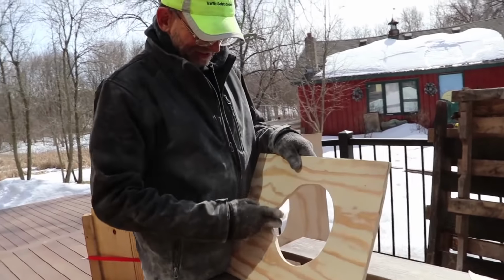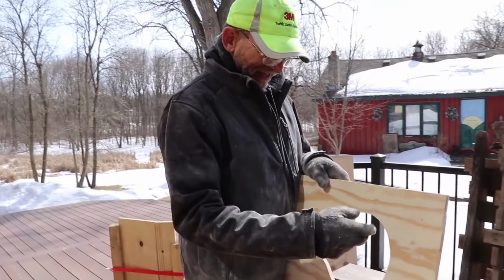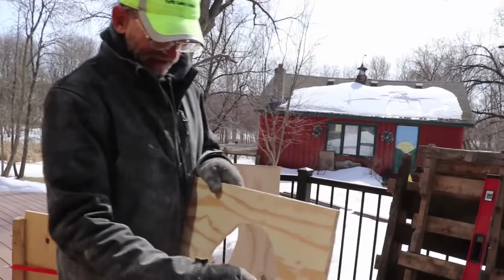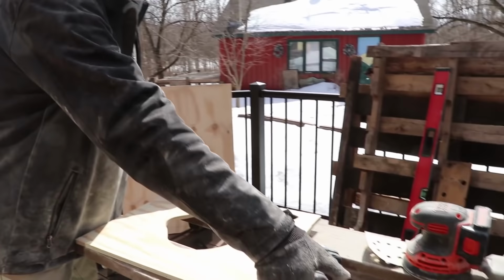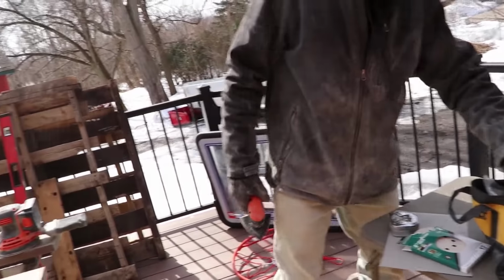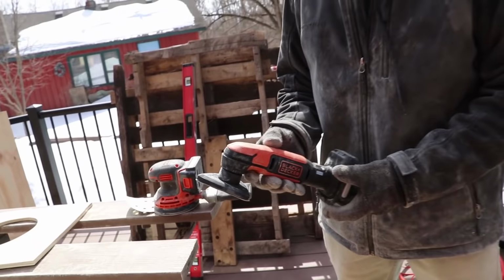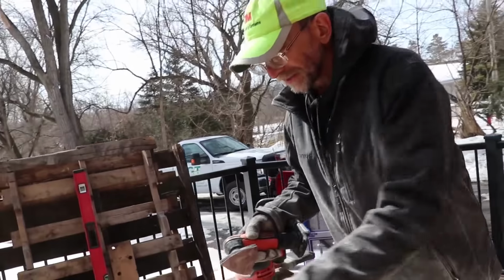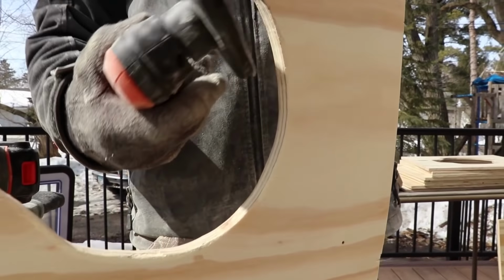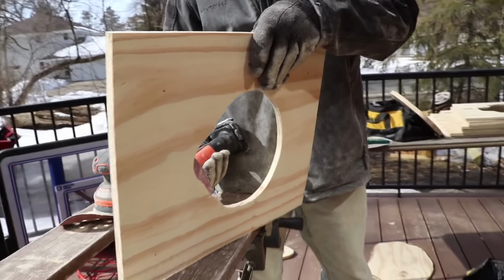A lot of hand sanding on this one, because all my insides I've been doing all by hand. So you do that because the shape of the actual sander doesn't allow you to hit every nook and cranny, right? Right. If I had a little round disc on there. Okay, but you have this one. I tried it though. I mean, it works, but it still doesn't ride the right way. So what kind of sander is that called, Frankie? This one? I believe it's just a corner. Okay. Corner vibrator. But that still doesn't give you what you want to accomplish. Right, it really don't get me in here, see, like in these corners, it's just tough. I just as soon do it by hand and be done with it.